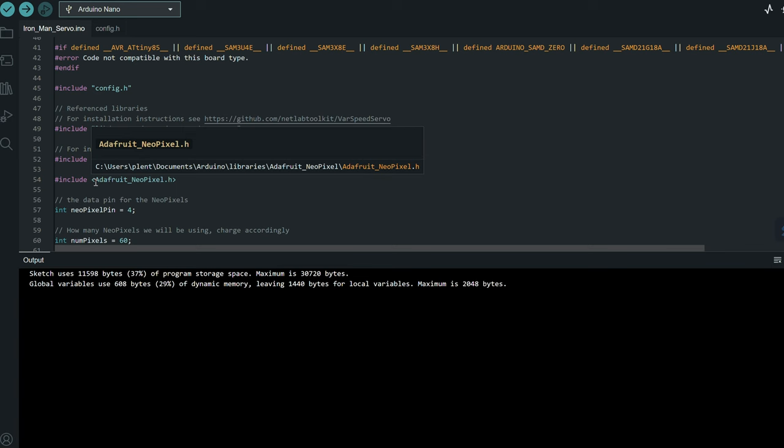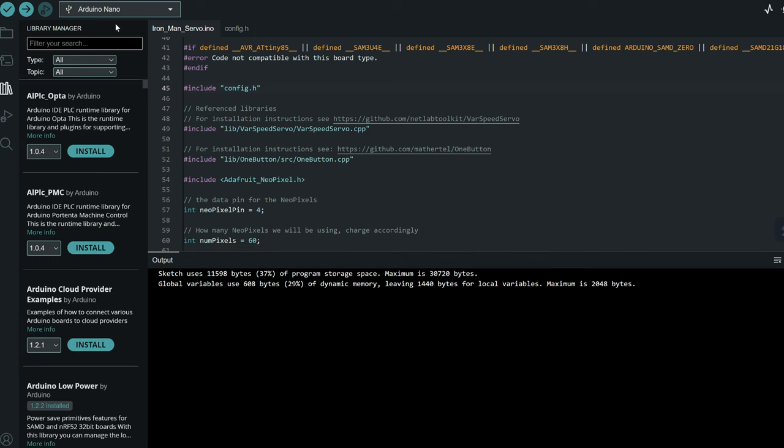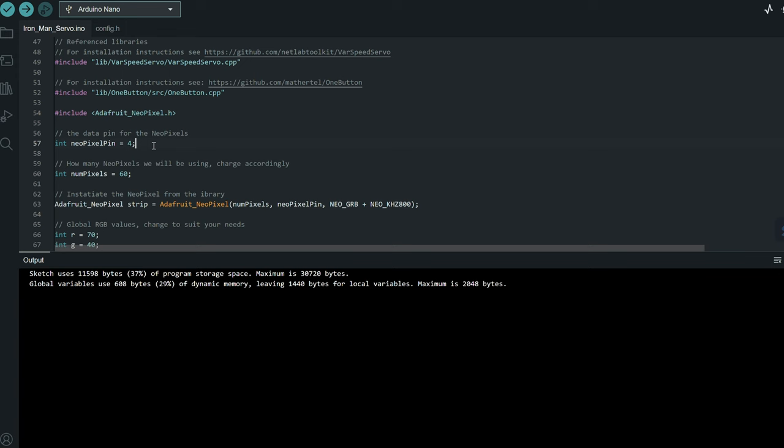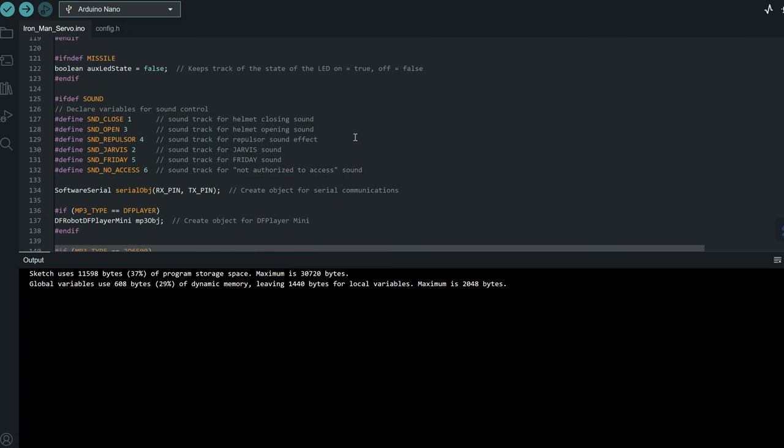If you don't have it enabled in Arduino IDE, go to Tools > Manage Libraries, type 'Adafruit NeoPixel' and it should pop up. You'll also add which pin you want the NeoPixel associated with — in my case digital pin 4. Next you tell the code how many NeoPixels are on that pin; in this case it's 60, but you can use more or less. Then you tell the code which colors you want — I have red set to 70, green to 40, and blue to zero, which gives a nice yellow. If you keep scrolling you'll see the sound effects section, but we're not modifying those — we're just going to modify the SD card.